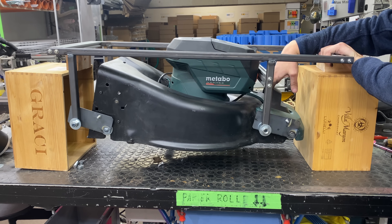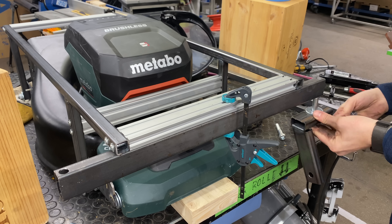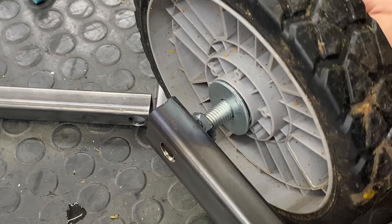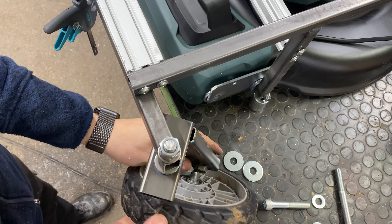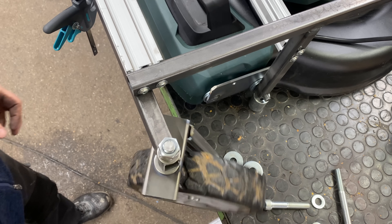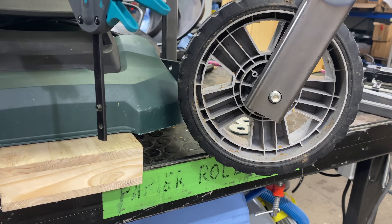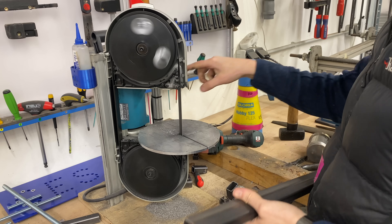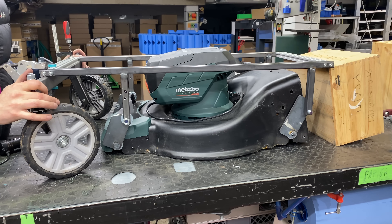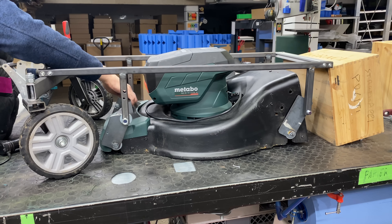The frame should stay stable and only the deck should move up and down. Now I can work on the front wheels. I'm adding the spreader bar to move them a little bit to the sides to make sure they don't collide with the deck. I like to add threads whenever I can instead of using nuts — that makes assembly and troubleshooting much easier since you just have to turn the screw and not hold the nut as well. In this case I welded the nut to the thin tubing, but for smaller diameters you can also just thread the tubing directly or use rivnuts. We've got the front wheels. Before I attach the back ones, I want to make sure that this motion gets locked in because right now it's difficult to maneuver since it always drops down.